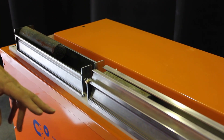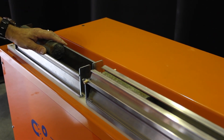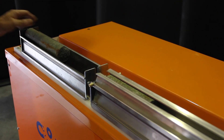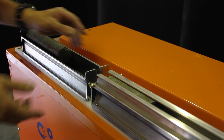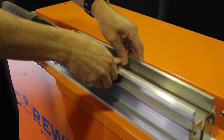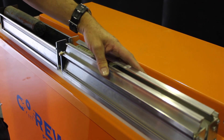We have two types of core guides available. There's a B core guide — this will take core anywhere from BQ to PQ size, and we usually use that for core that's not fractured, solid pieces. Or we have guides available with lids for fractured material: NQ, PQ, HQ, and BQ core guides.